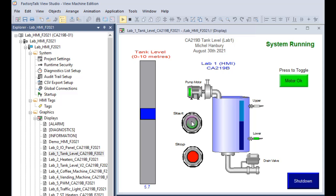When I press start, it does restart. The tank is about halfway but it remembers that it was filling and continues to fill until we get to the top. Now we're coming back down because it's draining, and I have an overload occur. The system goes off, all field devices are turned off. To restart, I remove the overload and press start. Notice the tank is about the same level — but this time it returns with the drain valve energized because it was draining, and it continues to drain.